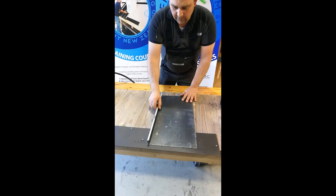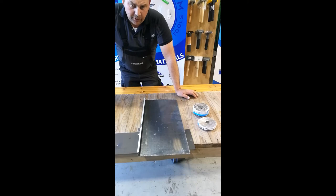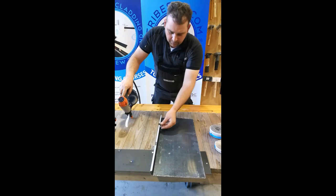It goes on here and you see the heights in here — that gives the clearance from the standing seam. This one here is a 25 mm; obviously some of you use 38 or 32 mm standing seam depending on the height. That gives you a nice clearance, sitting nicely onto the seam — shoot the nail there and boom, done. So that's one automatic through the top as well — done, your seam is installed.